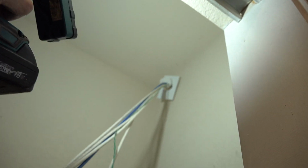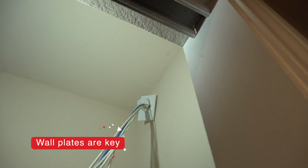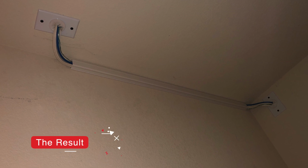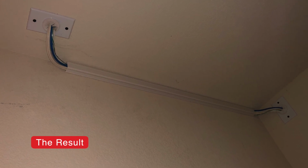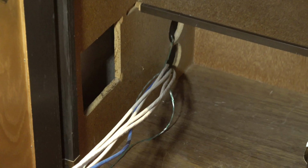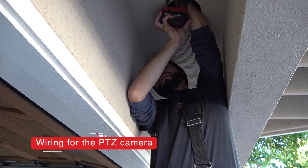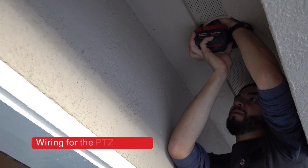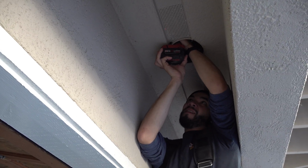Cut in here. Okay. Up that way, and very important, always put those wall plates in; don't try to do it after. And then it's gonna get tacked on the wall ceiling, and then up this to the 2nd floor. It's gonna go behind the chimney. See anything interesting? So what we're trying to do is get into the garage without going through the ceiling.